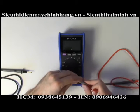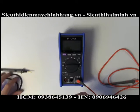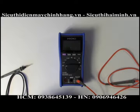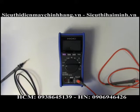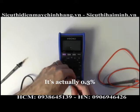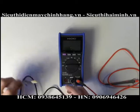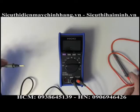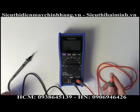I might as well give you some basic specs on this meter while I get set up here. It does have a DC voltage range of anywhere from 600 millivolts to a thousand volts across five ranges. On the DC voltage, its accuracy is within one-half of one percent, plus or minus five counts. AC voltage is six to one thousand volts over four ranges. This unit does include a low-pass filter, so you can cut out the higher-end harmonics.